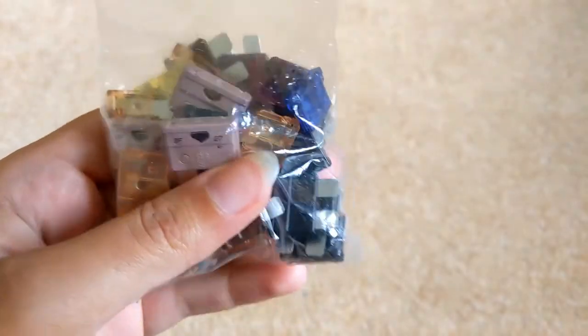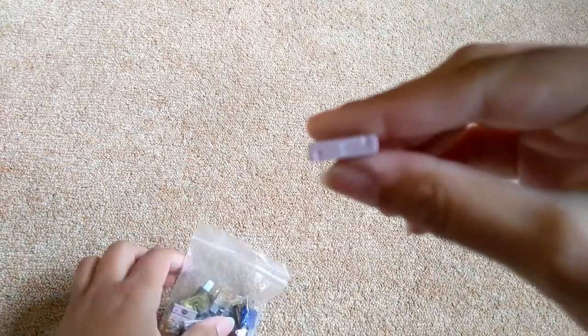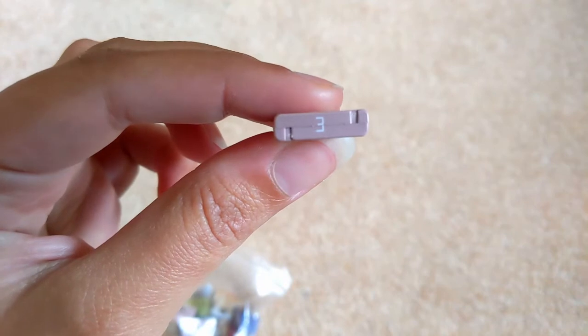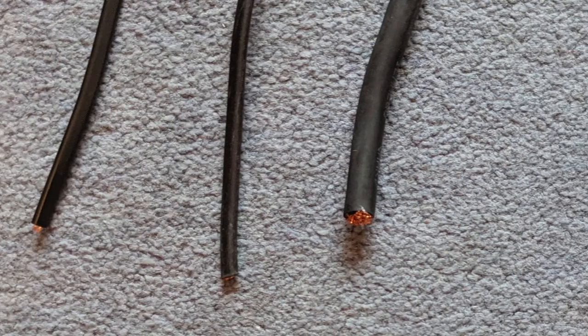Once you've got the current for your appliance or circuit, the next thing you can do is work out the size of fuse. Generally, you multiply that current rating by 1.25 to get the current rating for your fuse, and if it doesn't line up exactly with a fuse size, you just go up to the next size. The reason you don't match it exactly is because otherwise your fuse could blow annoyingly often. It's really important to remember that the fuse is there to protect the wire — so whatever wire you choose must be able to carry more current than that fuse rating. In the event the appliance short circuits or draws more current than rated, the fuse will blow first before the wire can overheat and catch fire.